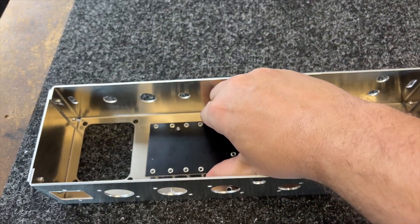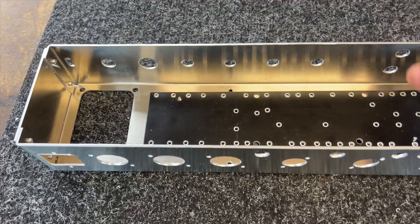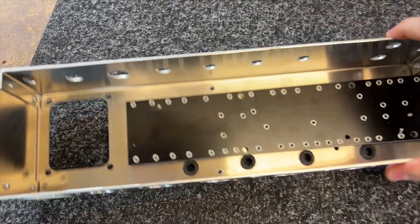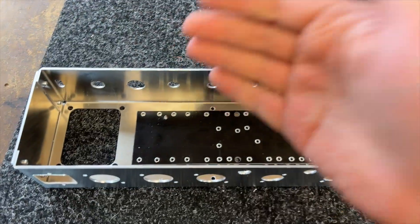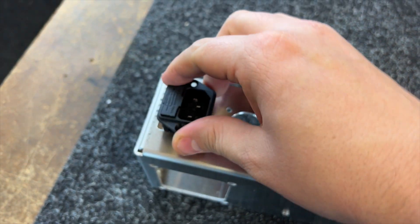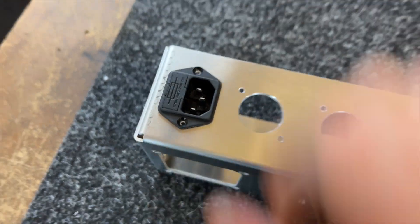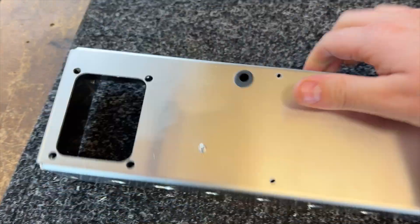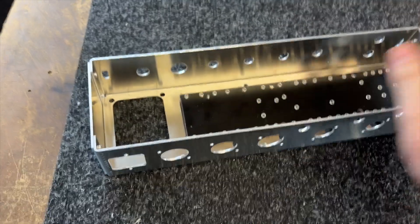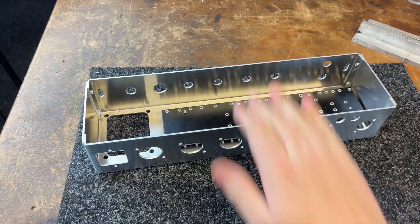So that chassis is now done. I've also done the board mounts — Loctite is in of course. Just checking that it'll fit. Now I can go through and mount all my sockets, jacks and things. I've even punched the IEC hole out for the IEC socket — so that's good to go. Starting to put some grommets in, making good progress. This is a full power Americana. Really happy — more updates next week.